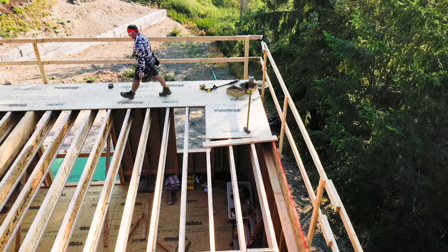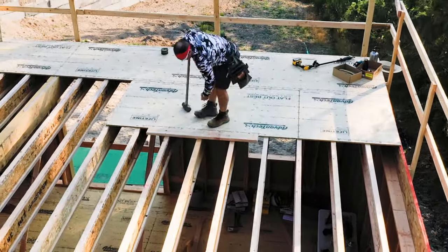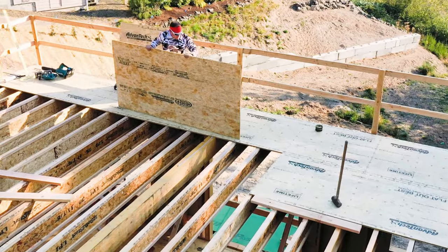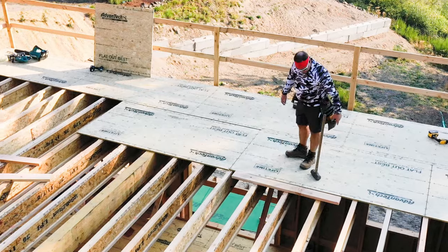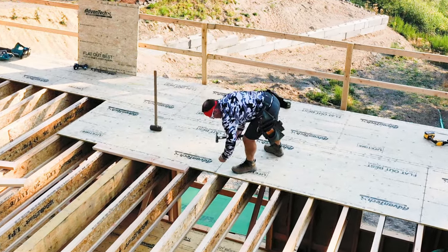In this case I'm tacking them one at a time. Normally I would use a nail gun for that — a hoseless nail gun — but the other carpenter on our crew was doing some pickup framing. So here I'm tacking them as I go just because it's row number two and I want to make sure that I get those all laid out to keep those joists straight. After that we won't have to lay out any more joists.